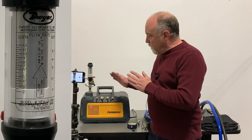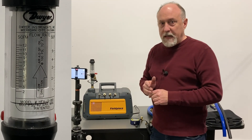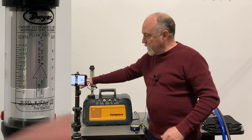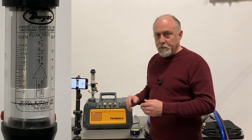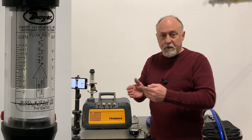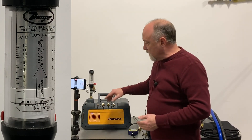When you're thinking about pulling down a vacuum, initially we have to degas. Degassing means we're going to pull out — if we're talking about a tank full of atmospheric pressure — we're pulling against all that atmosphere, and it's going to come down very quickly, and then the flow is going to drop off.